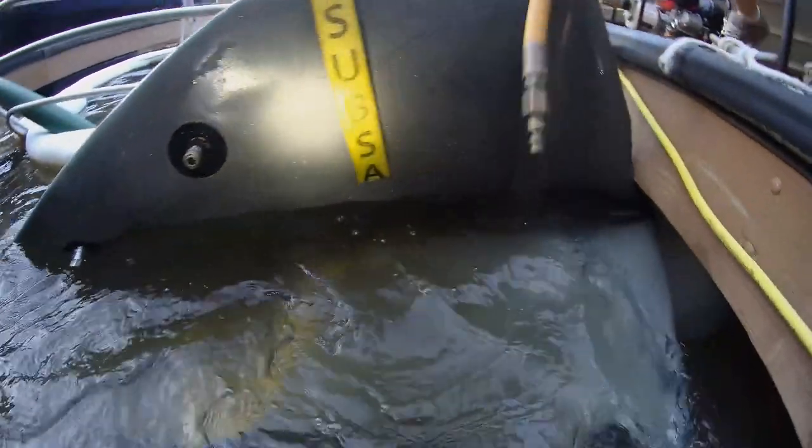As you'll notice later in this video, we have very tight, limited space to work with. If these bags happen to over-inflate on the side of the vessel, it's actually going to lift the dock up with it. So we've got to be very strategic about where we place these bags. The other diver and I will each take one — we're using two 2,000-pound bags for a total of 4,000 pounds of lift to get this vessel up. These 2,000-pound bags are a beast for one person, so we really have to trust our surface crew to drain air out of them and hold them in position as we're pulling them down.